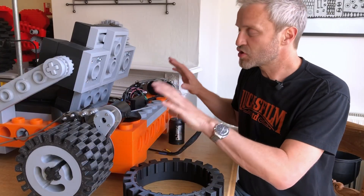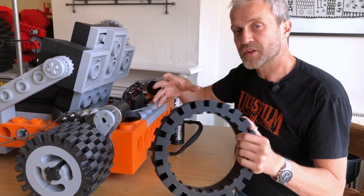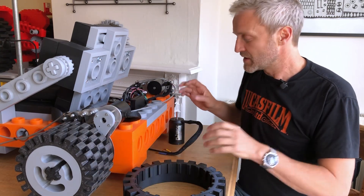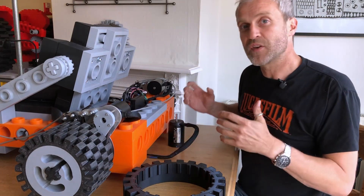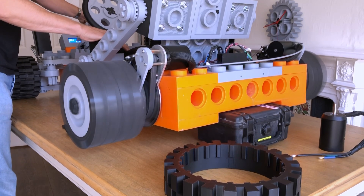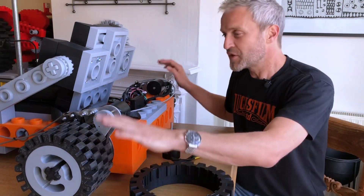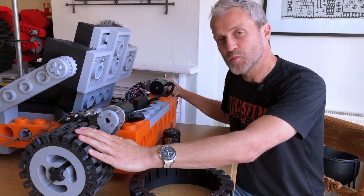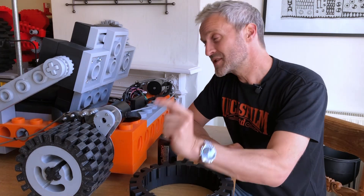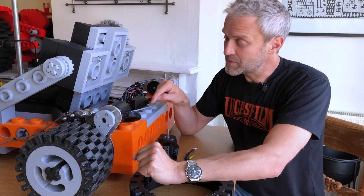Before doing anything else, I'm going to try the setup as-is with the bigger wheels, to see how much difference the acceleration loss feels with the larger diameter tyre. Then once I've tried that, I'll install the bigger motors, retune, and see if I get that acceleration back. The existing 6374 motors have been tuned up and are ready to go with the new controller. After EMF camp, I can swap back to road tyres with the bigger motors and should have 25% more acceleration — which is going to be hilarious, especially with the drift rims.